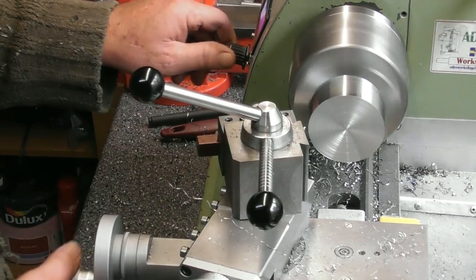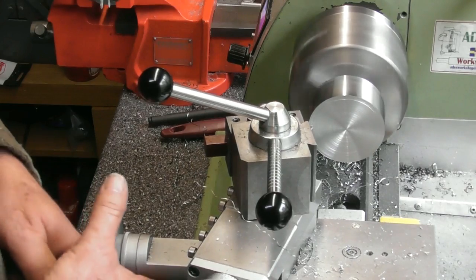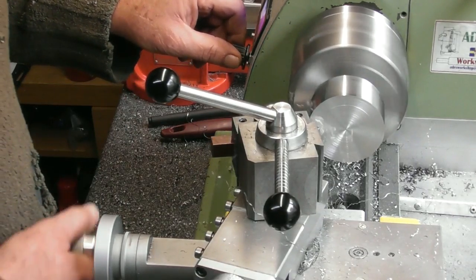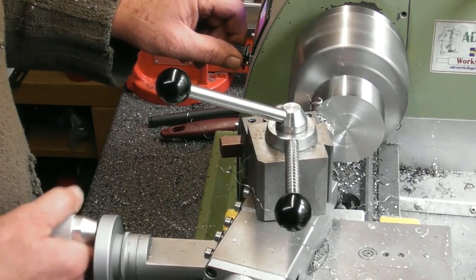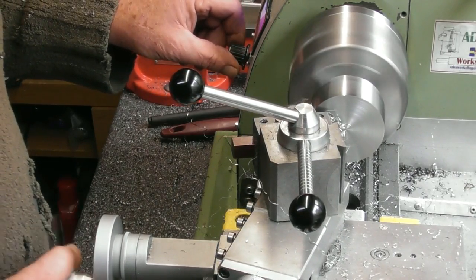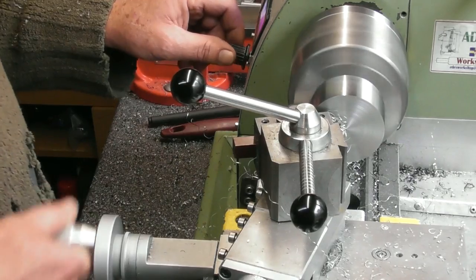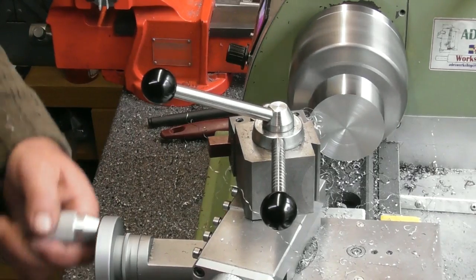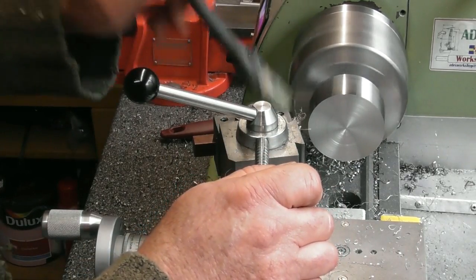And that will leave the overall thickness a mil up. It's roughing out, as I said, and this was very much roughing out. It was just over 20 mil to come off there, and obviously this is the smaller diameter now, it's 61, so it was 10 mil bigger. I got the tool right back into the tool holder, so I'm afraid you can't see the cutting tool. But yeah, the final 0.2, probably 40 minutes on that. I cleaned the bed of the lathe out twice.